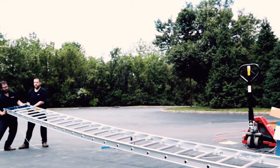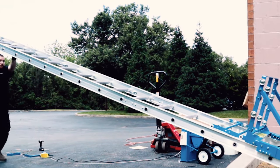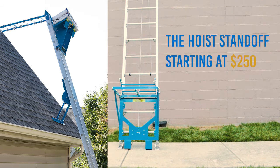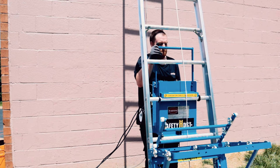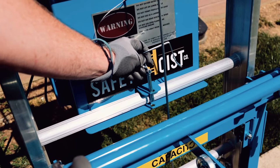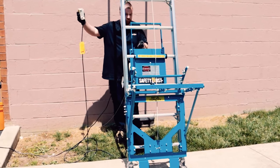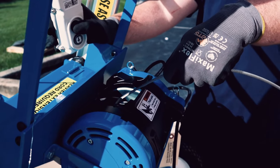Re-pin in place using the supplied clevis pin and pull to ensure the cable is snug and will not disconnect. You may now stand your hoist. Using two people, raise the hoist and move it to the building where it will be used, ensuring it is stabilized. For added stabilization and roof edge protection, use the hoist standoff. You may now attach the power pack to the third and fourth rung from the bottom. There are distinct black rings called stop collars that will keep the power pack from shifting — secure it with the attached anchor pin. Using the pendant controller, press the up button to remove any excess cable slack. Release the button as soon as there is no cable slack remaining.